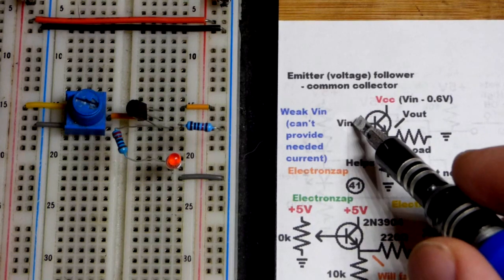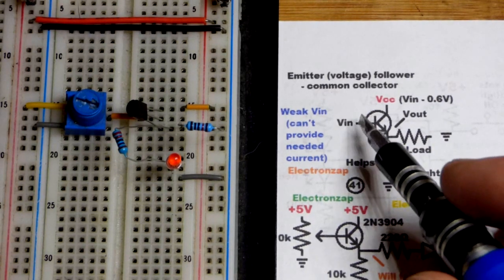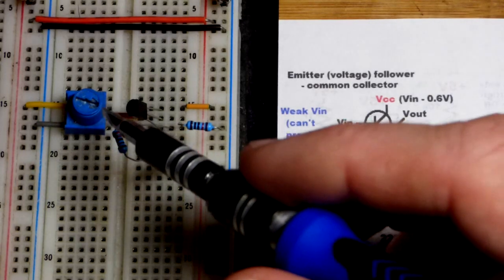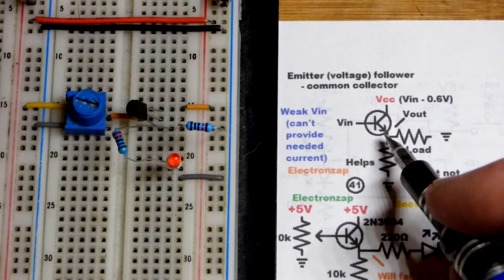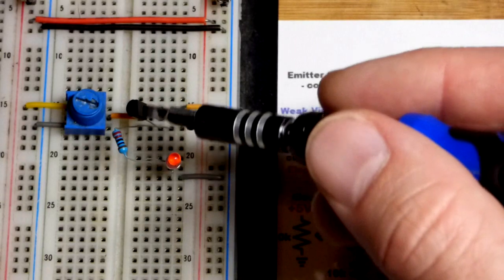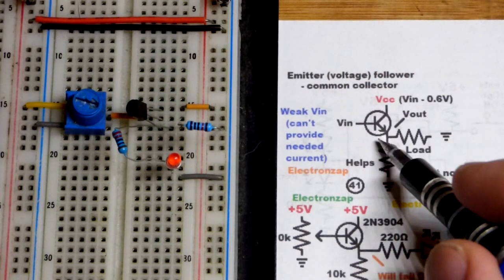When you set the voltage there, it's going to try to make its way to ground, and thus current's going to start trickling through there. Now, as I said before, if you ask for current out of a trim pot, that's going to throw off its voltage. So the little trickle won't though. So once current starts going, current's going to flow through collector to emitter much more so, like 200, 300 times as much current. And therefore, this will build up the voltage.